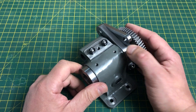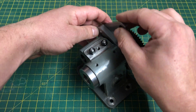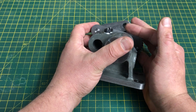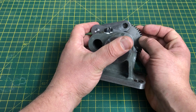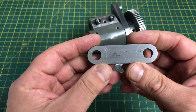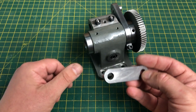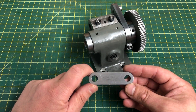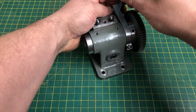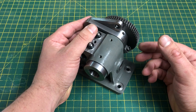We are back at the bench earlier than planned as I couldn't resist just adding this bracket to the project so far with a pin to see how it looks. And I've noticed a problem: the centre of the hole does not drop down far enough to reach the specified PCD for the holes that will be drilled in the gear. This is entirely my fault. The plans call for this part to be tapered but I didn't bother. In the book Thomas suggests you could leave the part parallel, but my part is going to need to be tapered just to allow it to drop the 20 thou or so it needs to reach that PCD.